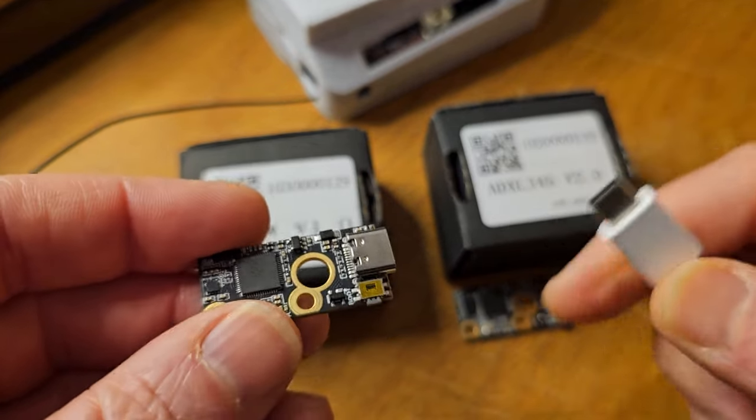Go back to the terminal to query the USBs. Type lsusb — that's going to list the USBs connected. You should see the Raspberry Pi RP2 Boot in the list. Make sure that's in there. You may see other things too, like the SKR Mini E3 connected, but the important one is the RP2 Boot, which lets you know you're ready to flash things to the Raspberry Pi.